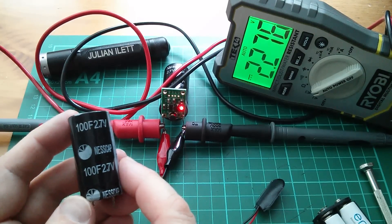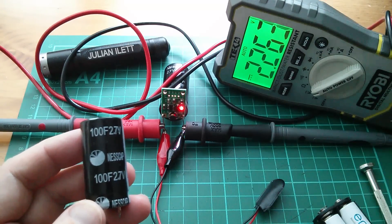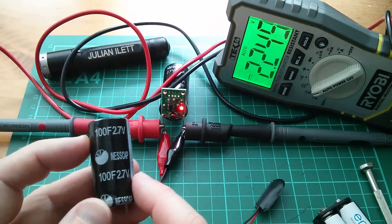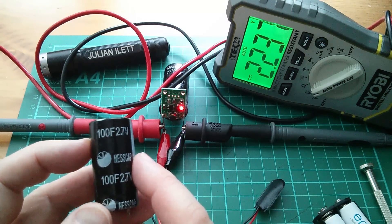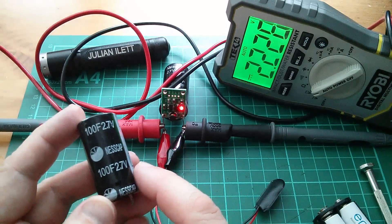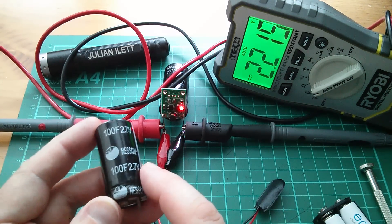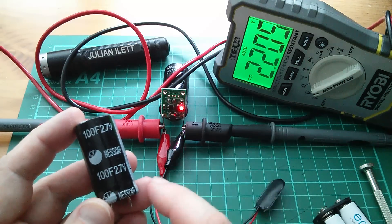Because this is so much fun I've gone and ordered some more. I've ordered a 500 Farad 2.7 volt capacitor — just the one, for a similar price, about four and a half dollars. I've also ordered a bank of supercapacitors on a PCB with all the capacitors in series so the voltages add up — around 15 volts — with the idea that you could use it in situations where a 12 volt battery would normally be used. That should be fun.